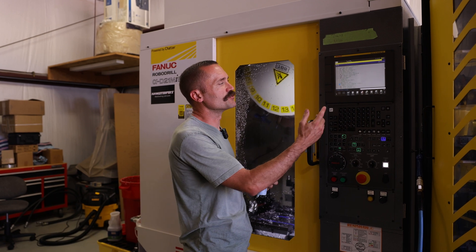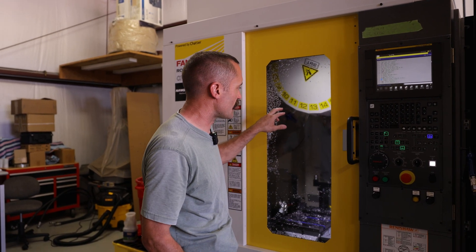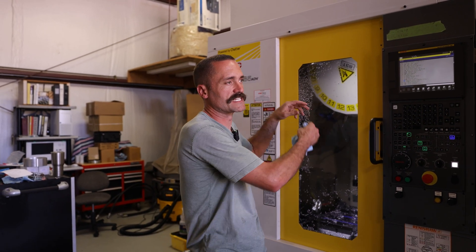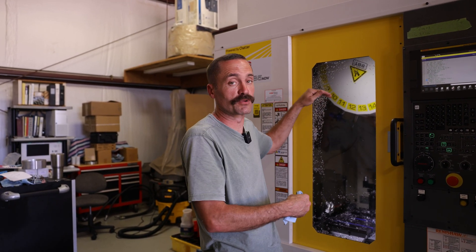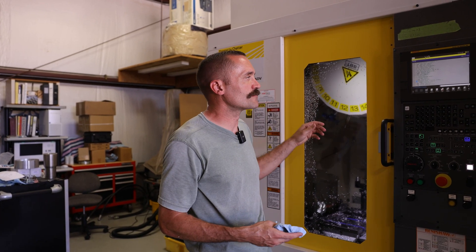A few things that I could do to technically make this better: currently I don't see why I would ever use air blast up there at the spindle, so I could take that 8mm line off and plug it so that I increase the volume of air coming out of those two lines versus coming out of three. But for now we're going to run it, test it, and I'll let you guys know if it helps us in our nighttime runs and helps prevent me from having to come in at 10 o'clock.